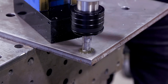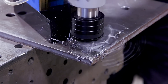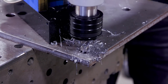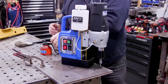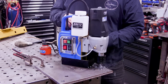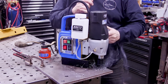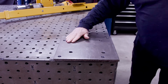Back to the mag drill to drill the four holes that will actually be mounting to the welding table. The holes are half inch, and I'm drilling nine-sixteenth-inch holes — just a sixteenth over nominal size to give me a little bit of flexibility. Then just clean them up and de-burr them.